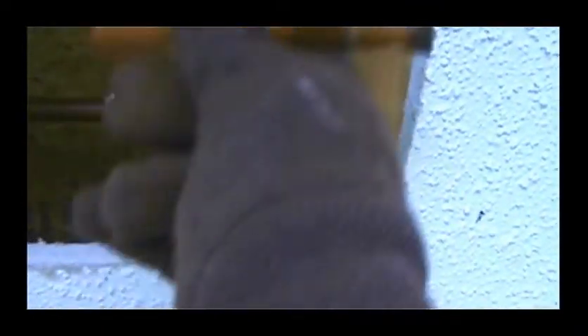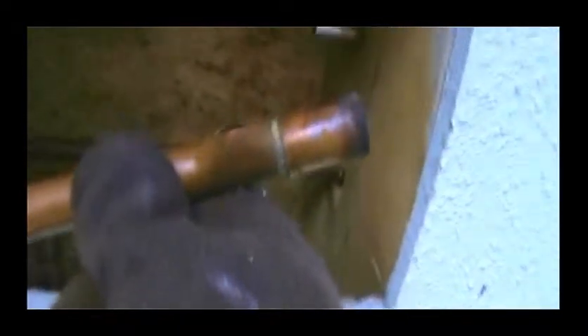So I'm going to get to repairing it. I've removed the old piece — the quality might not be great with the sunlight here — but that's where the old piece was. There was a coupling on it, so I cut it and unsweated it off of there. We got the water back on, our fix is up there, all soldered up, no other problems.